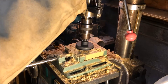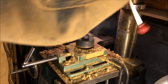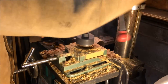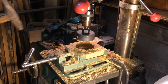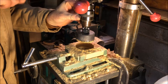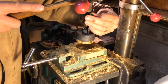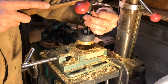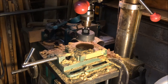See, it's starting to smoke a little bit — I'm just going to keep going. That's got it cut out. Now your wood always gets stuck up inside of there, so they've got holes in the top so you can knock it out. You just got to go back and forth because it's going to wedge in there. As you drive it one way it wedges the other — just work it back and forth. By the time you get down that far you can usually just pop it out. Remember, those teeth are hot.